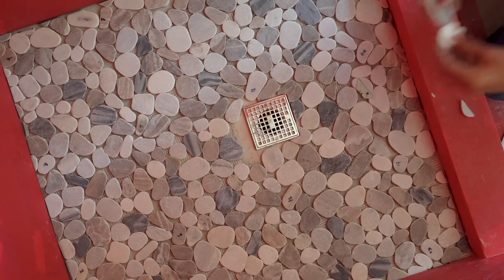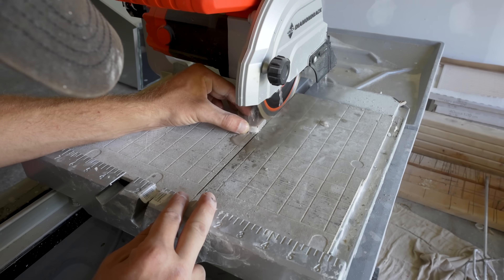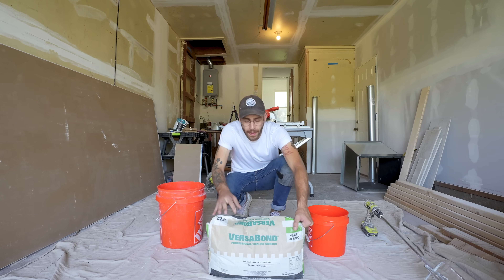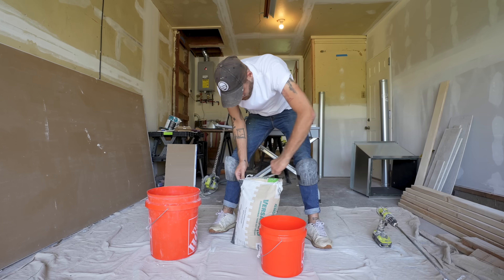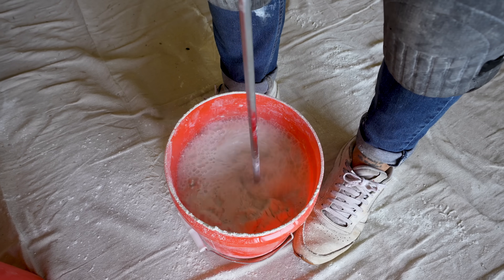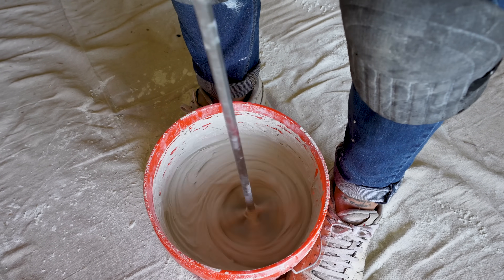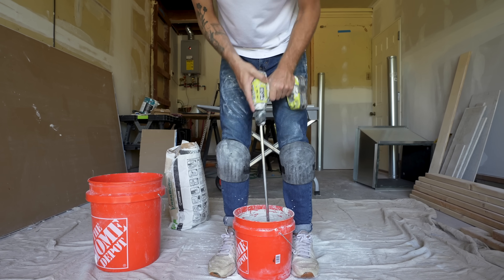My perimeter pieces were a killer fit — I just had to make a couple of alterations to those small individual stones I had already cut. With that, it's time to move on to installation. To attach our tile to the mortar bed I'm going to be using standard thin-set mortar. The only difference is this is white colored because I'll be following up with white grout. Be sure to follow the mixing instructions on the bag — I was going for a thick pancake batter consistency, and once it's mixed you let it sit for about five or ten minutes, then mix it one more time before it's ready to use.